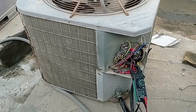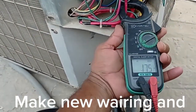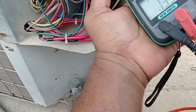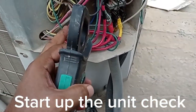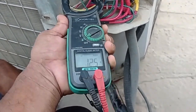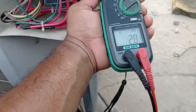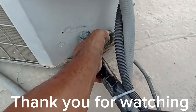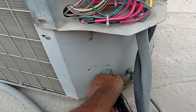This is the first floor, unit number 3, daughter room — 17.4 ampere. Second phase: 13.9 ampere. Third phase: 12.5 ampere. Indoor motor: 2.8 ampere. Return also okay. It will take time — when everything is finished, it must run two days, at least 48 hours. Then it will become cooling.